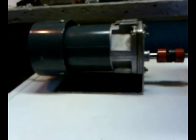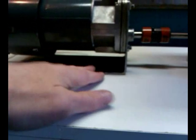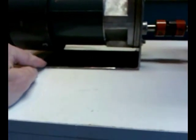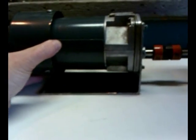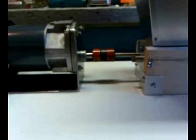The next thing I did was drill holes for the motor. I'm going to take this off in a minute and show you. I've got three holes drilled — one here, one opposite this corner, and one in the middle. I left enough play in there, made the holes big enough to scoot this thing around a little bit, because getting it lined up perfectly is almost impossible without some play.